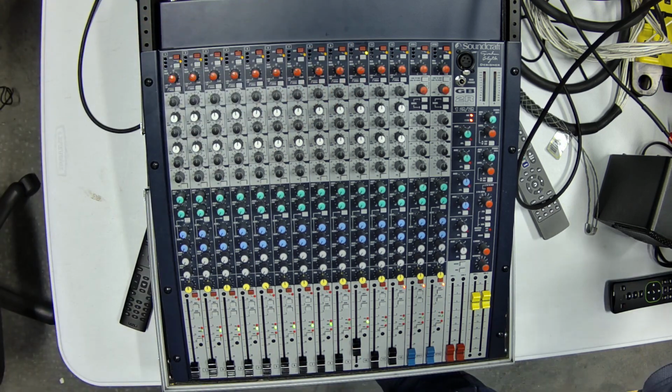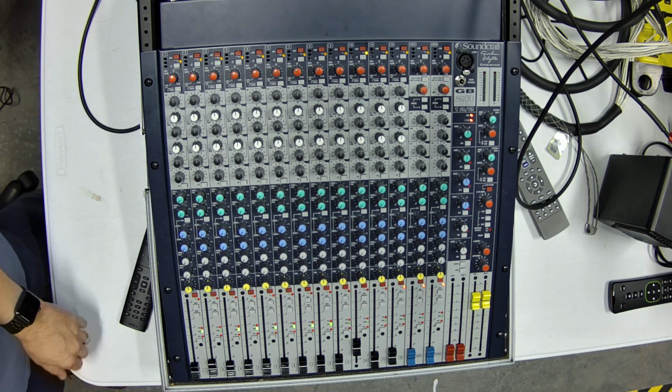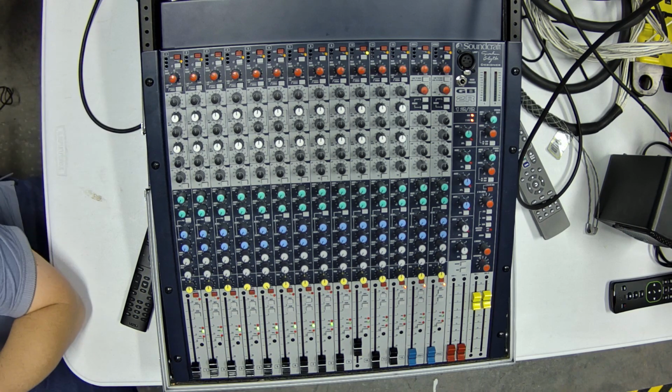Don't underestimate how big of a difference this can make. Doing it on one signal, nothing. Doing it on 50 makes a noticeable difference. If you suddenly eliminate that buildup of low frequency energy across several input channels, you hear the difference. Everything gets a lot cleaner, easier to mix. The detail is suddenly coming through a lot better because that low frequency energy isn't building up and masking anything. So that's what that's really for.